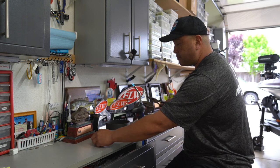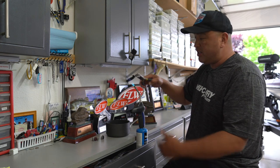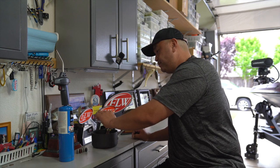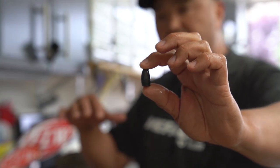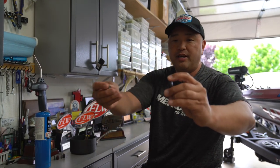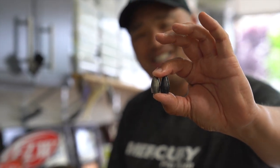So we're going to go right into the ice water, and then you just leave it in there and let it cool down. Then you grab another one. Your pliers are going to be hot, so be careful. You just do the same thing over again and you leave it in the ice water. I can actually pull that weight out of the ice water now — let me dig this out of here. If you notice how dark the color turned from what it was, it's not chipped up on the end or any of that stuff. I really like it because of that dark matte finish — when it's dropping through the mats and through the shade, it just hides or disguises all that unnatural, super shiny shade. And if you look at this other weight that came that color, you'll be able to see the difference in those two colors. It just gives me more confidence, recycles my tungsten and saves me a lot of money. Thanks for watchin'.